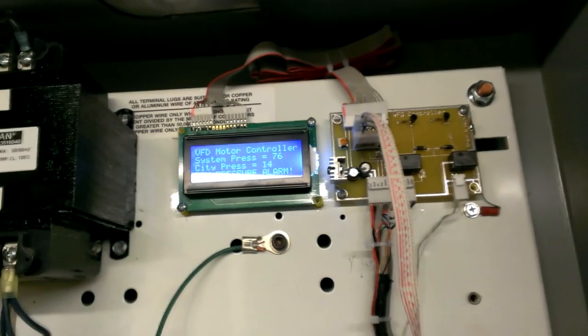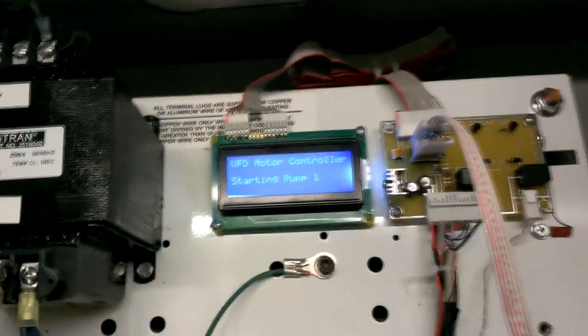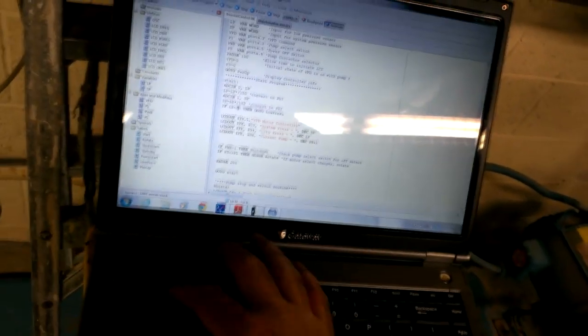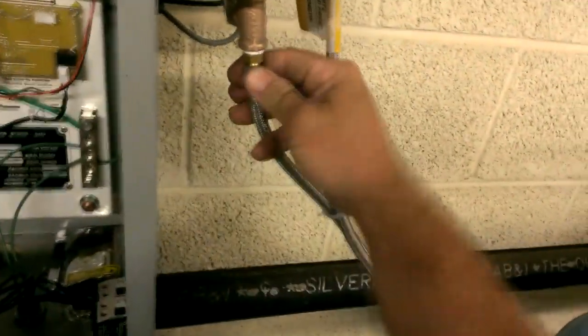We need that pressure down so we can kick the cutoff — about 30 PSI. There it goes, turned that off — that worked. It goes below 30 PSI inlet and shuts down. Turn the water valve back on, bring it back up. I probably better lower that just a little bit — there's never any air in the line or anything like that. Try 20, actually. Shutting that water pressure down again. Okay, it's still working — cool.